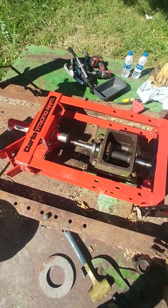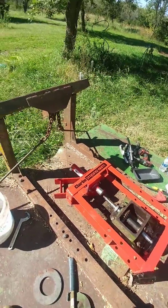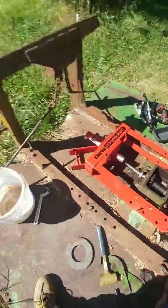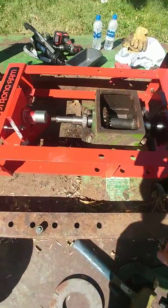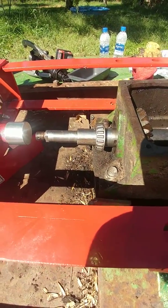What I'm doing is pressing in the second bearing on the input shaft. This is a John Deere 407 Gyromower and it has a slip clutch, but because I was running it on an International 1086, the clutch didn't slip and it mashed the Woodruff key.